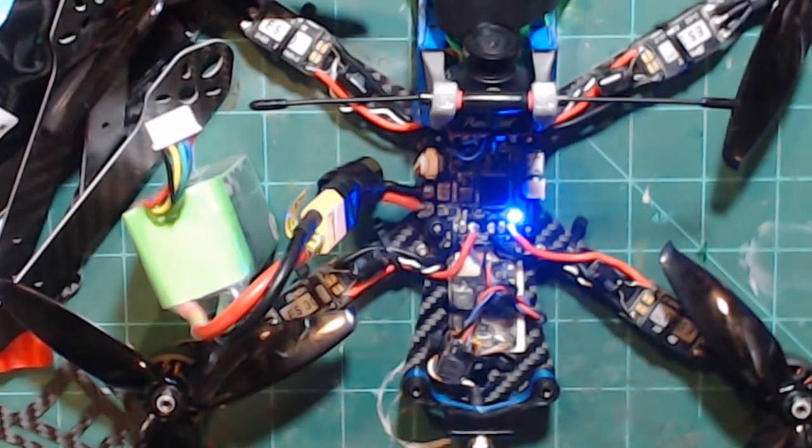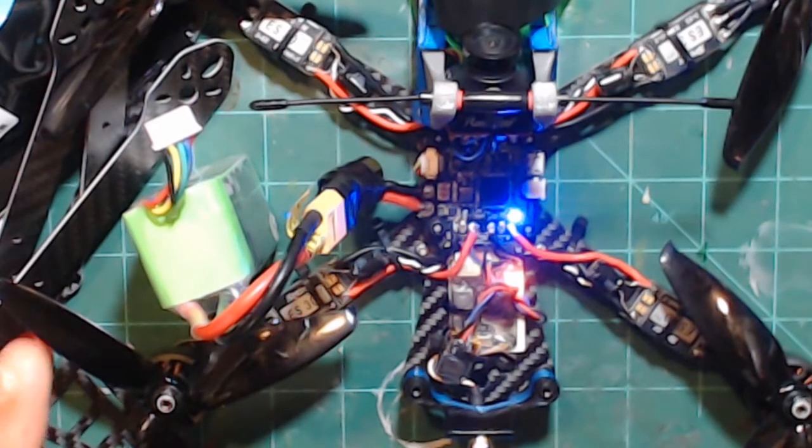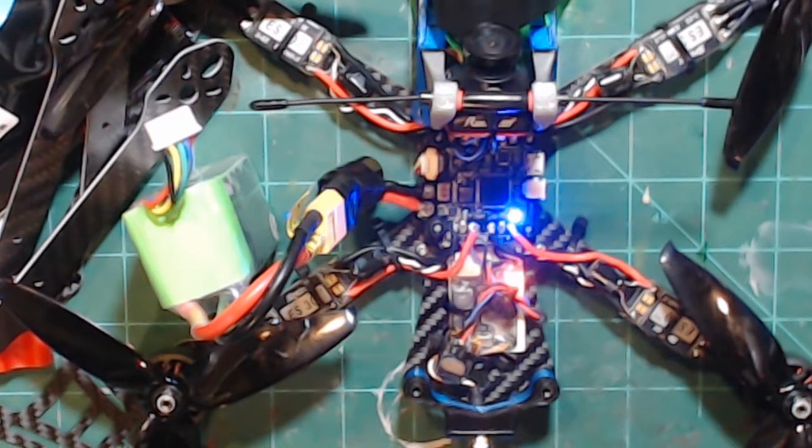The thing is, with Betaflight 3.3, I'm not sure when this started, you don't even need to hook up buzzers anymore to our ships because we have D-shot beacons built into them. We have the regular old-school D-shot beacon, which means that everything will start making a tone at a predetermined time, however long you set that. And then you've also got the beacon tone with the buzzer switch that you can turn on. So I'm going to flip that on right now, which is actually going to turn that buzzer on too. And that's all great if you have battery power.